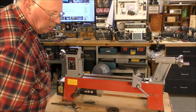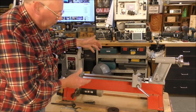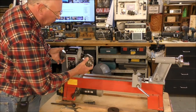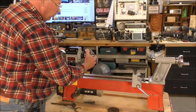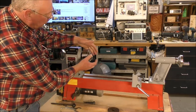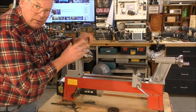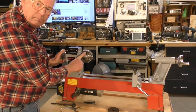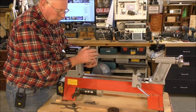Okay. There's also another holding device, which is called a chuck. I'll just get one. And this is a chuck for a wood lathe. You see it's got four teeth on this, and this screws on like so. So then you can catch out of your bowl with this. Now I'll take you through the process of making a small bowl using these different tools. This chuck probably does not come with the lathe, and neither do the chisels. So we'll just take this off.